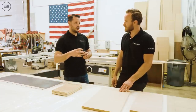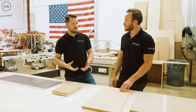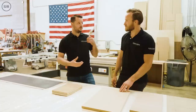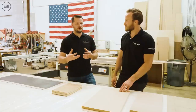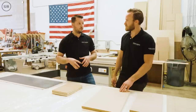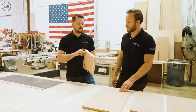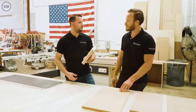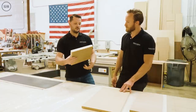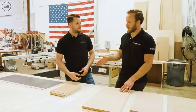If you take two pieces of three-quarter inch, you can clamp it up with standard clamps and cauls, but you're still going to have a little bit of waviness — you won't get even pressure throughout the whole piece. This is a perfect application for the vacuum bag: a nice tight seam through two pieces, dead flat, and your shelf is good to go. Super simple.